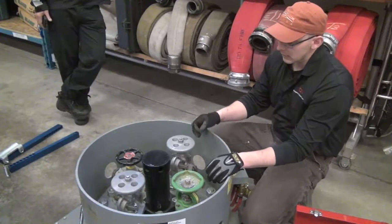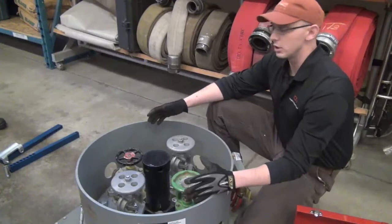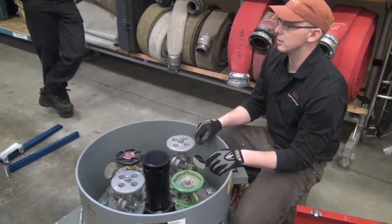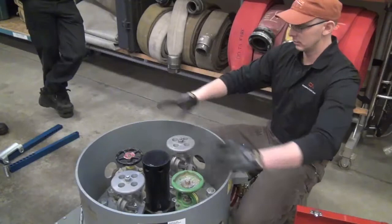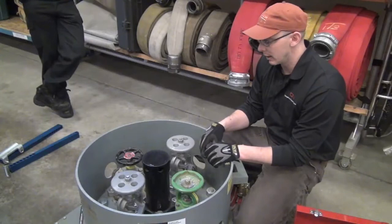Do you guys have any tricks for identifying where the leak is coming from on a chlorine car? We've got some ammonia and Q-tips. The ammonia and Q-tip deal works really well. It's very possible to get a leak that's not even at a dangerous concentration but you can smell it - it smells like a pool. If you get up here and do all the easy stuff and just can't find it - and you're on air so you're not smelling it - that's where the ammonia and Q-tip comes in handy. Start high on each valve, take the Q-tip around the packing first, then down around the valve seat, around the plug, all the way down. You'll see when you get to the spot.